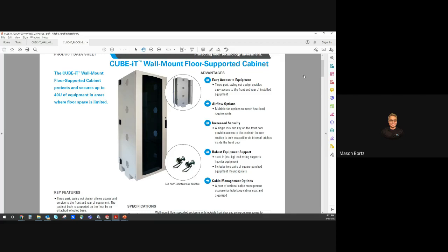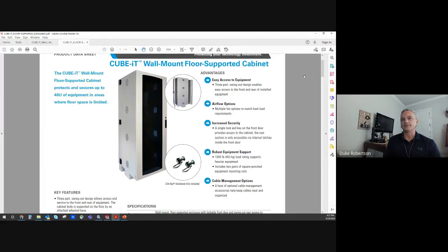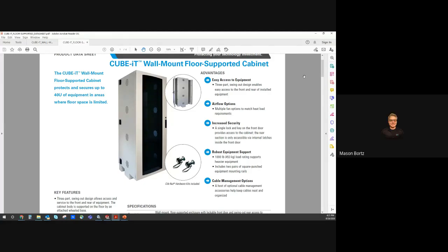What's the expectation of how to wire that, I guess, is my question. Well, every scenario is going to be a little bit different, but I can appreciate the difficulty. Even in the best of access scenarios, it can be difficult just to get your hands in there and lashed and secured. Yeah, the beauty with the hinged version is you can get to the backside of it, even if you have the full front filled out with equipment. Otherwise, if you want to add a drop, you'd have to pull out a neat patch or a horizontal cable management bar to get in there. That would be my concern, because I have seen those before and considered it, but without the removable side panel, it makes it fairly difficult to do any work on it.